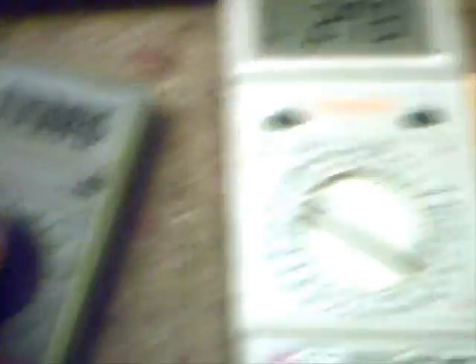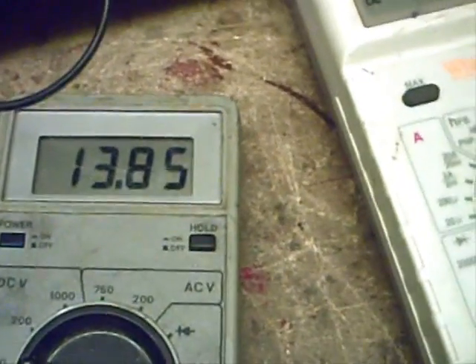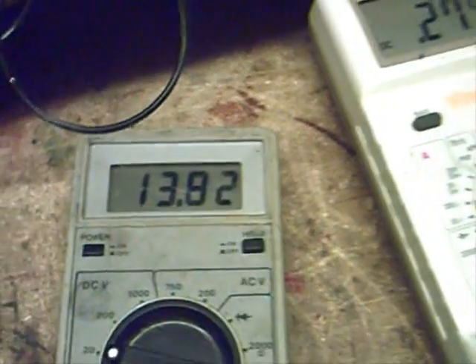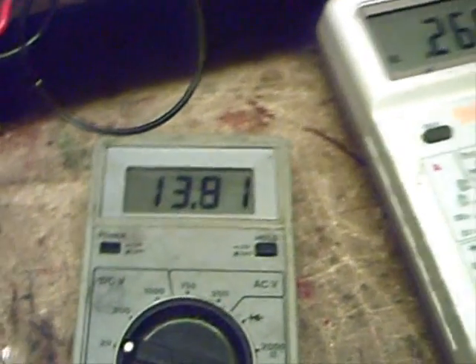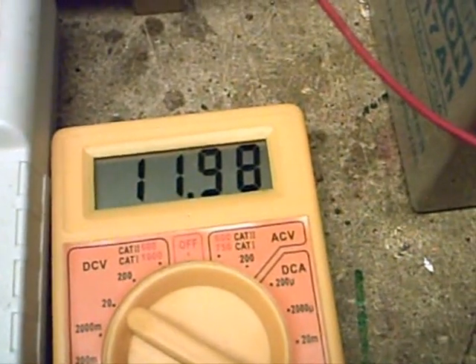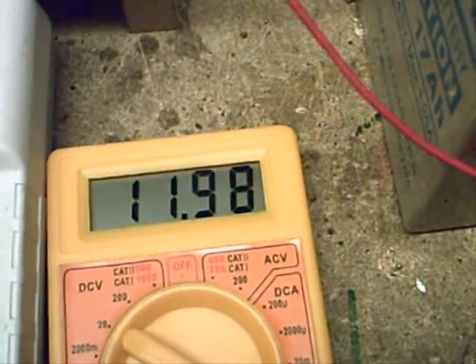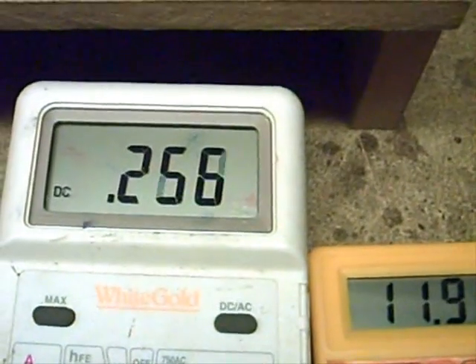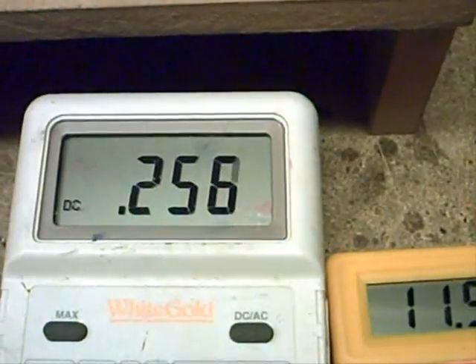It was about 9, 10 volts, and it's now charging. Just to show you, that's the reading from that battery — it's now charging. I've got to put some sort of regulator on; it's actually overcharging very slightly, it went to 14 volts a few minutes ago. But you can see 13.81 there. The supply battery is 11.98 solid, and that's the current it's actually using at the moment.